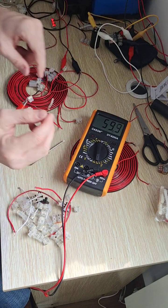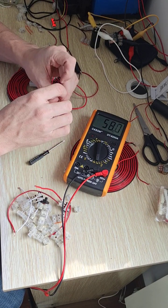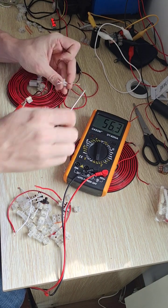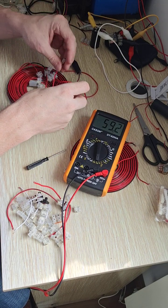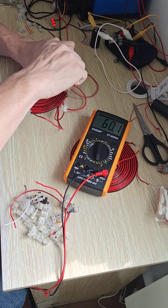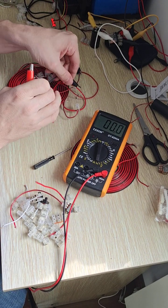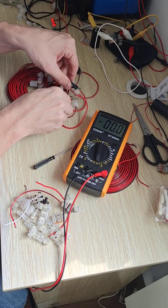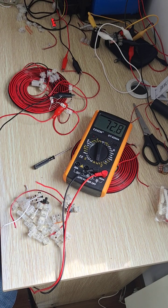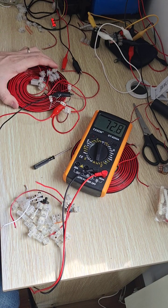So just hanging out here. Again, this one 59 volts, and I'll put this one in and check the voltage straight up so I don't get confused with what I'm looking at. Put my rectifier on this one, so I've got my negative and my positive. Of course, and that's saying 72 volts now. So let's double check what I'm doing here. So this is the top coil, 72 volts.